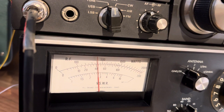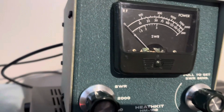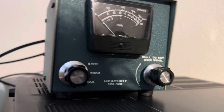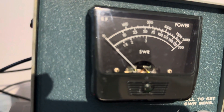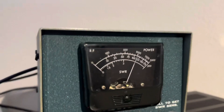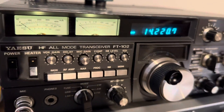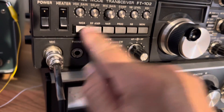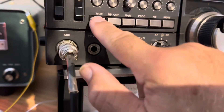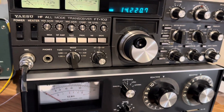You can get about 600 watts out on 20 here — let's keep it at 500. This meter here is showing what's going out of the transceiver into the amplifier. We're driving it with about 45 watts to get 500 watts out. To get 600 watts out, I drive it with 100 watts — you see the big difference, it's not worth it. Take the drive down. There's 500 watts right there, and we're driving with about 45 watts. That's a good conservative way to run the radio on 20 meters.